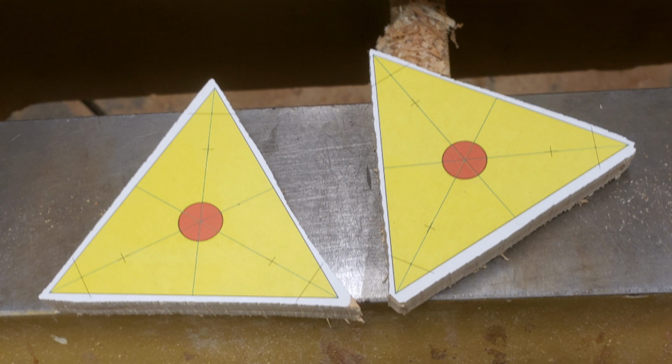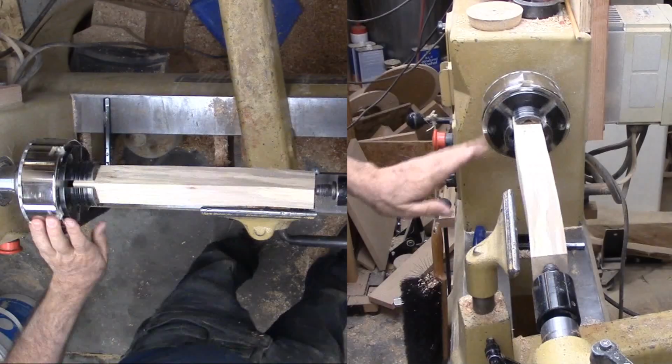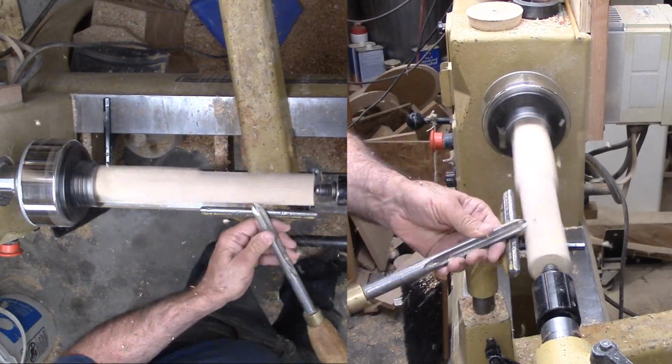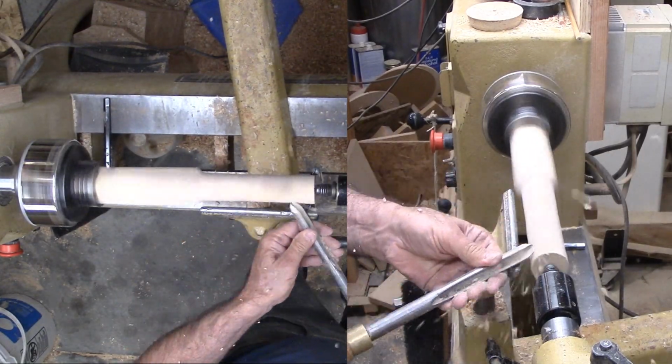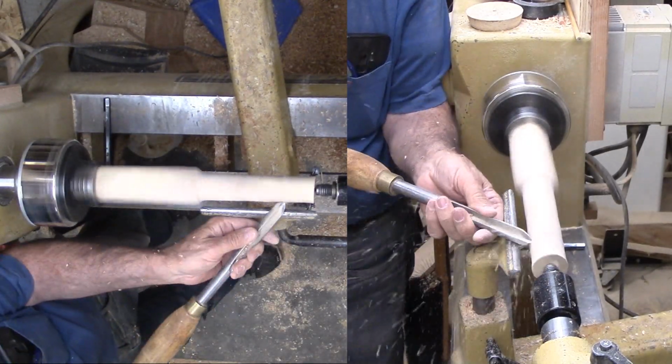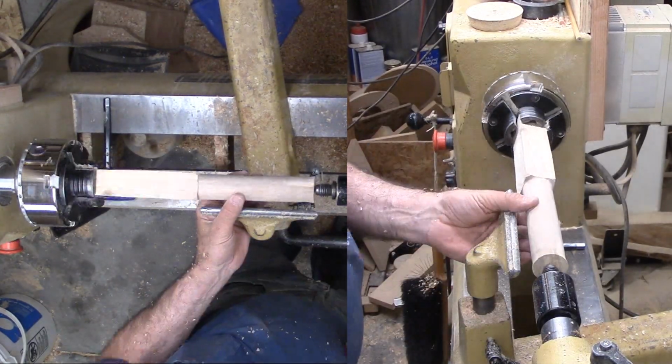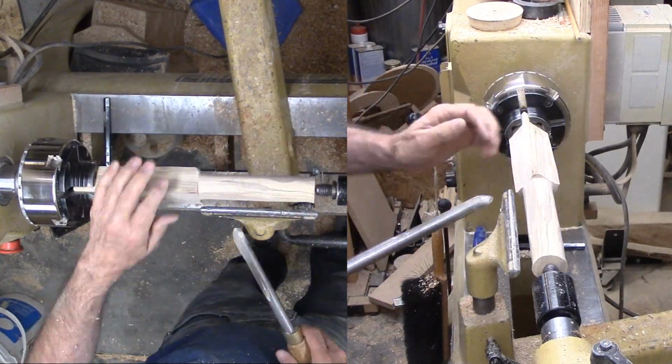At the bandsaw, I cut a shallow cut to position each wire. Finally, I drilled the center hole and cleaned off the remaining paper from the pattern. For the center spindle, any wood will do. Figure out how much you need for a handle and a knob on the opposite end, then determine how far to put the ends apart. Add these together with a liberal amount for 2 tenons that will go through the plywood and into the spindle on the other side.